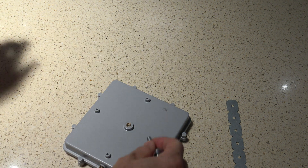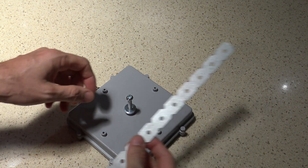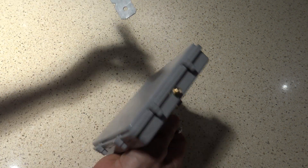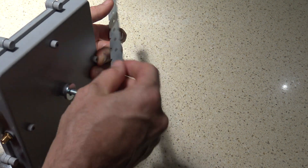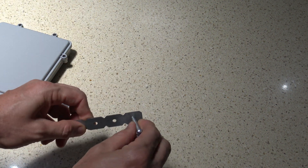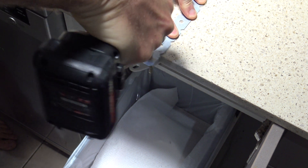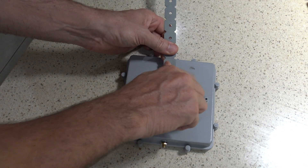On the back it's got this little nut which is the same thread as the bottom of a camera. What I'm thinking of doing is using a bit of metal like I've got here, sliding that up under the tile and screwing it to the truss in the roof from on top, then having the antenna screwed into the bottom. I'll cut this bolt down so it's only as long as it has to be and drill out those holes so the bolt can fit through.